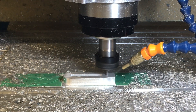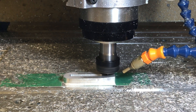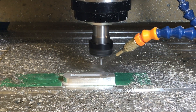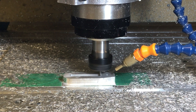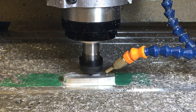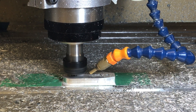I'm just doing the bore here. I went a bit fast on this one — I got worried for a second, thinking it was going to be destroyed, but it was all fine. Maybe I should do more cuts like that; it was kind of fun watching it back. So now I'm just doing the contour cleanup. There was 0.2mm left around the work after all the adaptive cutting, so this just allows me to use the whole edge of the cutter to clean up that edge.